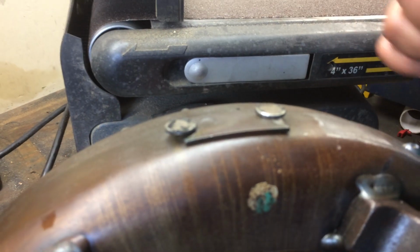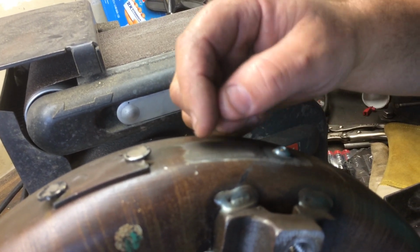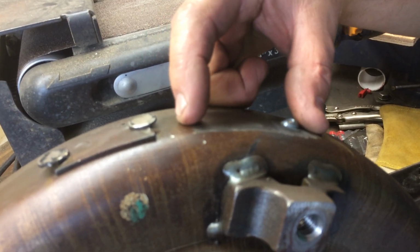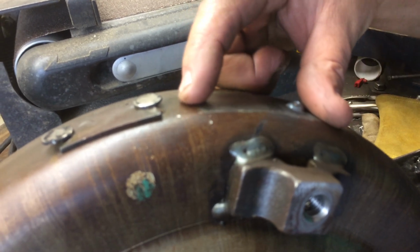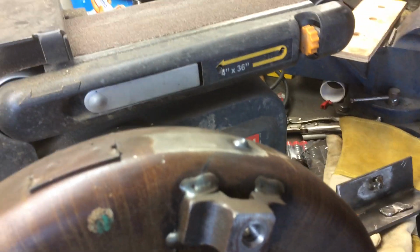So now on my torque converter, as you can see, I've cleaned this area up. But if you look at the torque converter in my vehicle where it fell off, you'll actually see this same exact shadow where a weight used to be. So I'm going to put it right back in the exact same spot and then do my 2 tack welds to hold it in place and call it a day. So hopefully that works out for me. Hope this helps somebody else out.